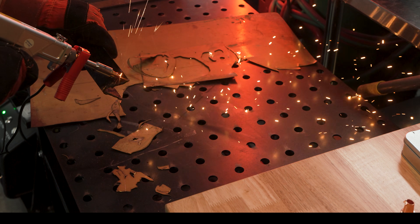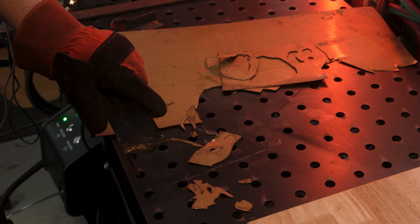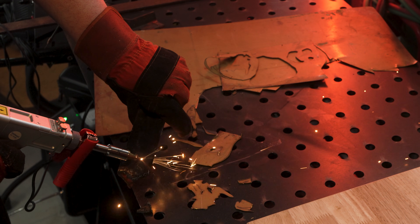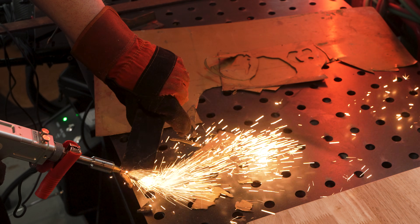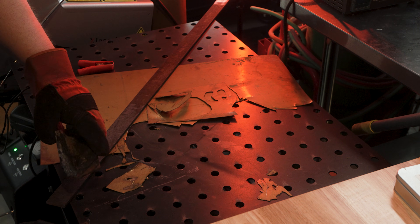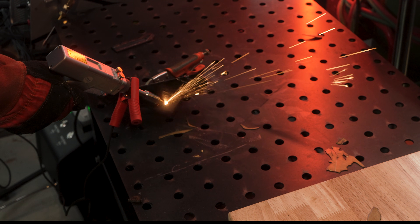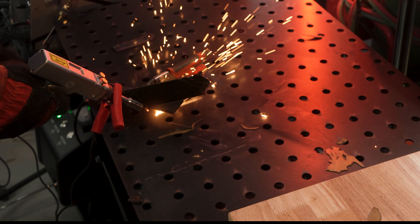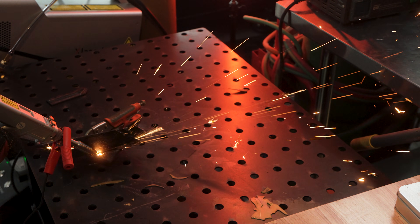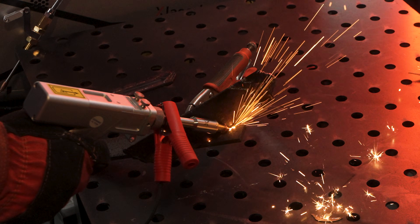Okay, let's try cutting that angle iron again. I'll try just the tip in for just a minute. That worked, so it's definitely capable of cutting the thicker metal too. I think I mostly need to slow down and be more precise. I may also need more air pressure so it's not re-welding itself during cutting. I can see that it will take some practice and maybe experimentation with settings. I would definitely like to be able to cleanly and quickly cut down bar stock for the knife and sword making builds we may do in the future. So I'll try the 1084 bar stock again and try clamping the angle iron to use it as a guide. I don't quite get through here, though I do see it getting some penetration. I think slowing down more and improving my technique will be key, and better work holding for stability too.